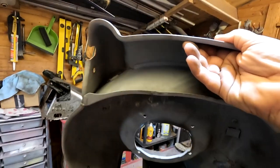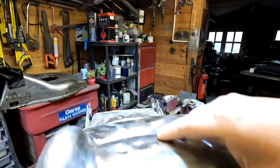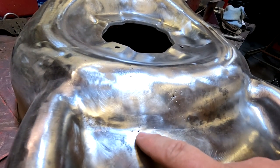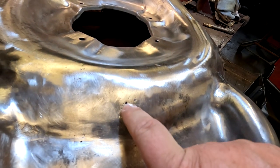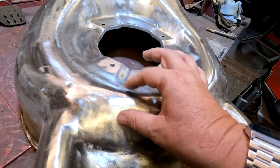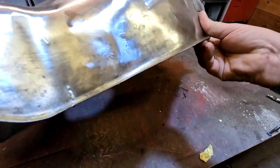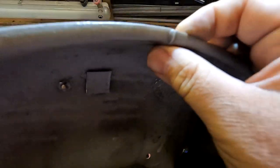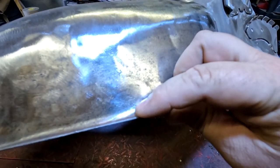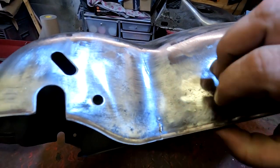When we turn it back over — oh there's one in there as well, look at that — he's done some right good patchwork in there, and there and also in there as well. So he's had a lot of work done, but unfortunately the finish just at the front here, there's a hole or a couple of holes there, two or three holes there, a hole there or two holes there, and there's a couple more there basically. So they're going to need a little blob of weld — they'll probably go bigger and bigger but I'm going to have to fill them, because as I say if I powder coat straight over that you'll just see it and it'll look terrible. These have been done as you can see there and also up there as well, so there's plenty of welding work done on it.